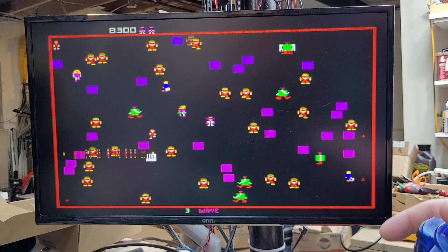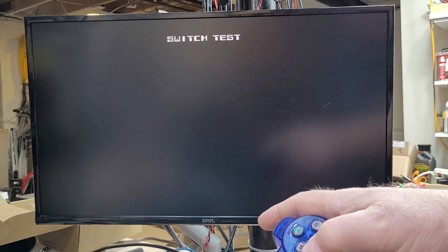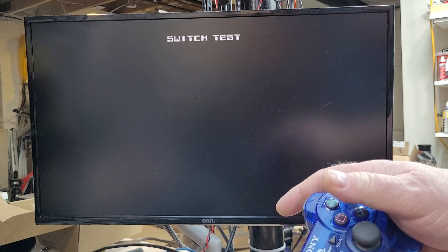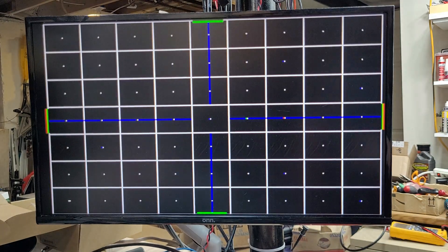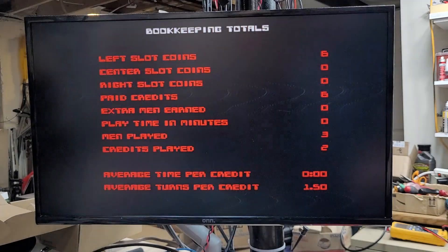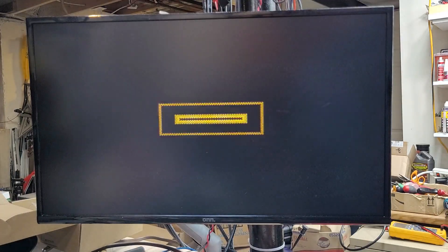I coin it up and start — you can see it's playing great, all sounds are really good with the new filter caps. Dropping into diagnostics: all ROMs good, no RAM errors, CMOS is good. It loops through a few sound tests, then goes back to one. The switch input test shows all inputs working — up, down, left, right, fire up, fire down, left right, coin, player one start, auto-up, the DIP 3 diagnostics in the coin door, and advance. Then we get grid lines for setting convergence, color bars, bookkeeping data, and the configuration menu where you can set free play, attract message, and so on.